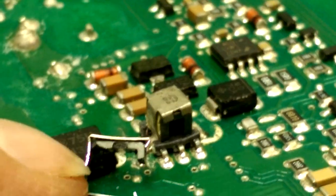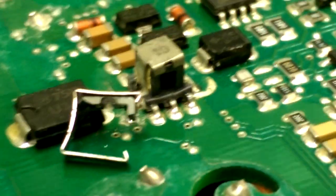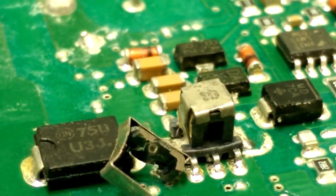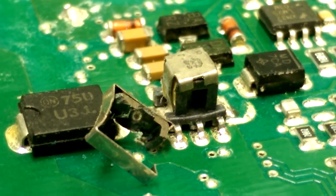I don't think this is going to be a successful repair because we've got a very custom-looking transformer here, which looks like it's just got ferrites in it but I don't see any windings. It's a six-pin device. I think those solder tabs on the side are just for structural stability because it's a tall device. Whoever dropped it caused the inside of the case to contact that little square transformer and smush it. I'm betting we're not going to be able to find a replacement — I have never seen something that looks like that. It looks pretty darn custom, but if anybody knows where to find such a thing, shout out.